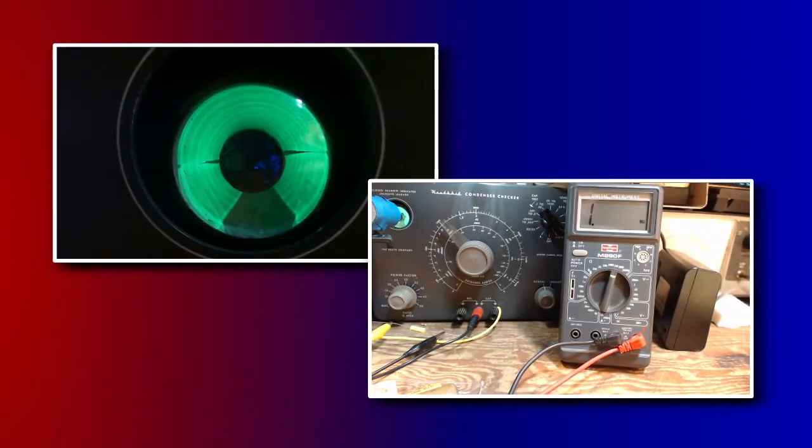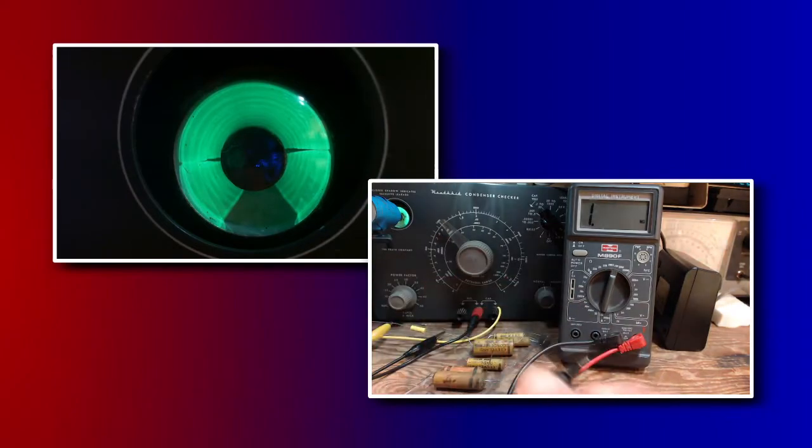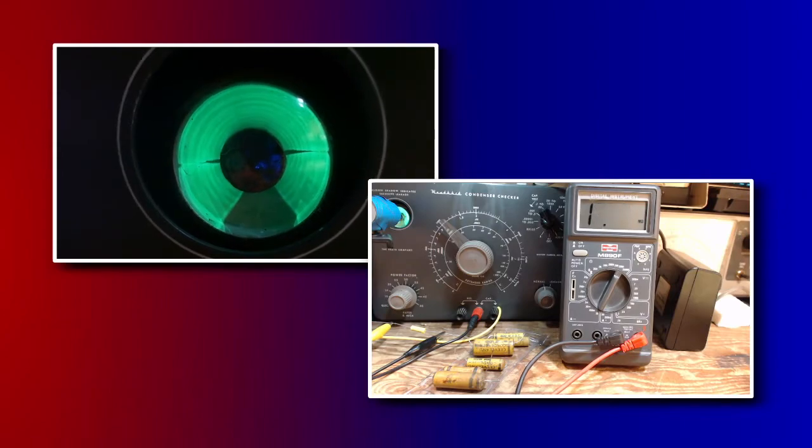Let's pick a real leaky capacitor here. Take this big one here. And I'm going to measure the resistance of it. I'm on the 2 meg, let's go higher. 20 meg scale. Well, first, see, it's a negative reading from the residual voltage. Also, the meter can only deliver so much current. It takes a while to charge the capacitor up. It's up over 10. Bingo, over 20 megohms on this meter.